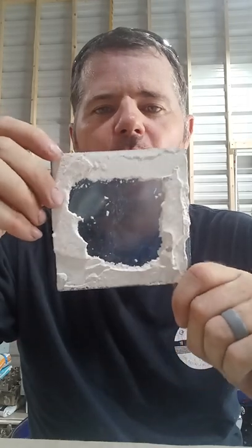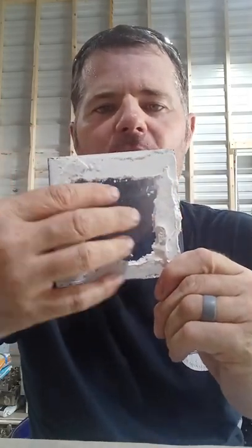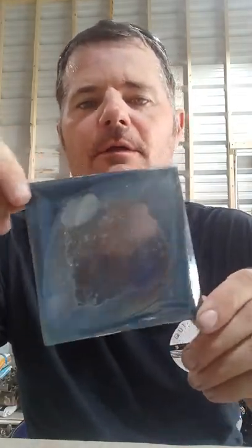I looked at the backsplash and we had experienced something called ghosting. This is a term that I had never heard before as it relates to the tile industry. This is what ghosting looks like. Through the tile, the mortar right in the center all rolled to the edges on the majority of the tiles, and it left this really ugly void. So that's what it looked like when we showed back up to grout.